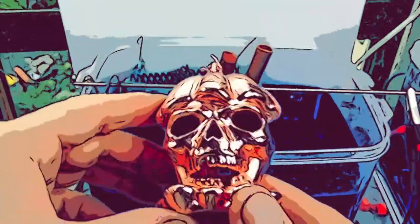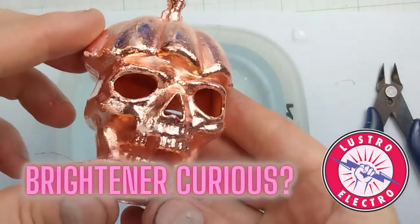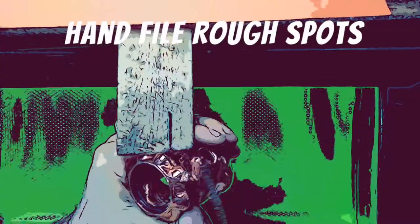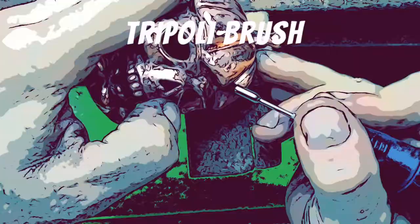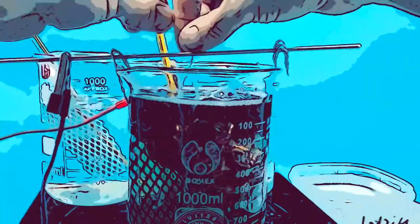This is the part that I love about electroforming — it's so rewarding. It's time for a little bit of cleanup at the bench: first the file, now a rubber wheel, and then some Tripoli compound on a brush. Keep watching for a two-toned patina. Using a desktop polisher I'm going to give it a quick buff. Now the copper electroformed skulls can go to the next step.